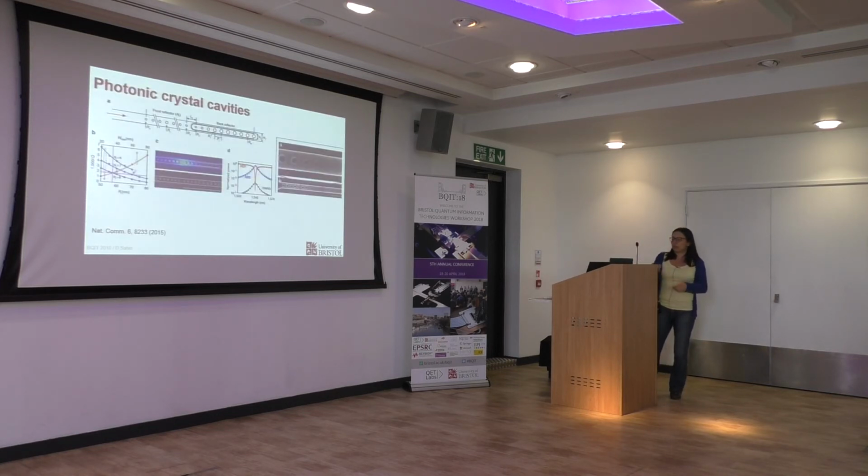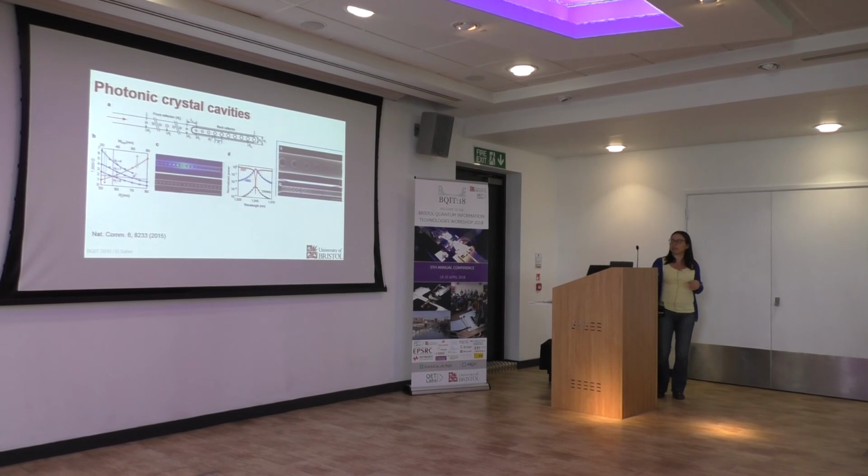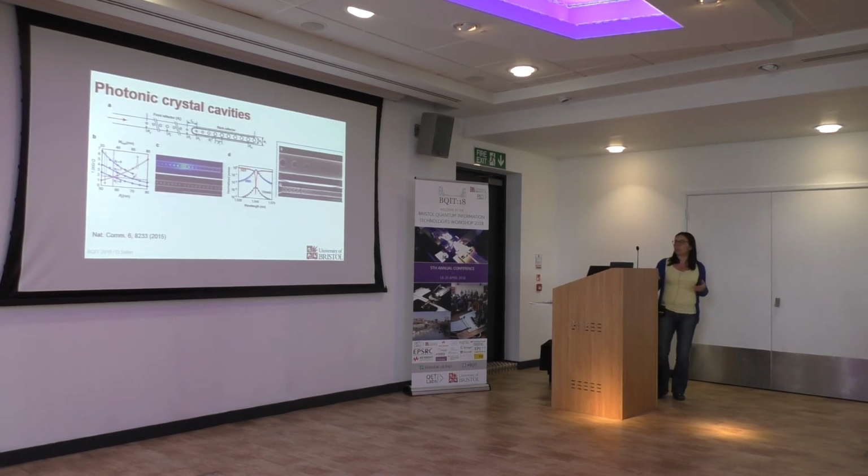And this design we have studied has already been demonstrated on a different platform. That makes us quite excited, because people have used the same concept, the same idea of a photonic crystal, and they demonstrated near unity efficiency from these detectors. The only disadvantage probably here is the photonic crystal cavity they use, because they are quite sensitive in terms of the hole size you drill and the positioning of them. And as you can see, they are quite small, like 50 nanometer or so in this region.